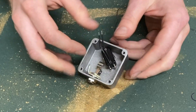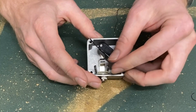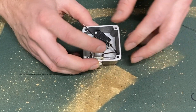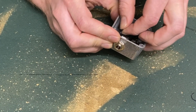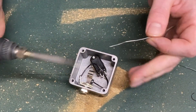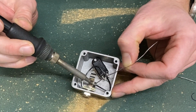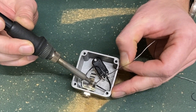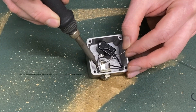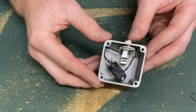You may need to hold the part from the inside while tightening to avoid shifting. Once they're tightened down, run each wire to each open jack lug — it does not matter which wire goes to which lug, so choose whatever way is easier for you. Following a similar pattern, clean the tip of the iron, add some fresh solder, place the iron against the lug and wire, wait a few seconds for it to heat up, add solder until it flows, remove the solder, then remove the iron. Do this for both wires on the jack.